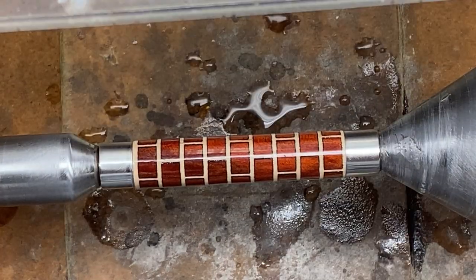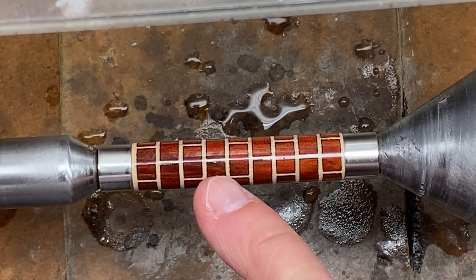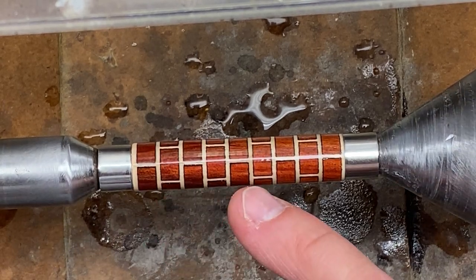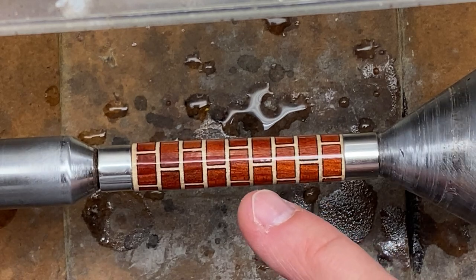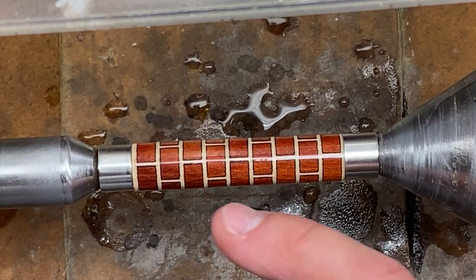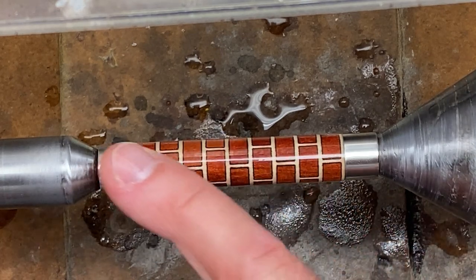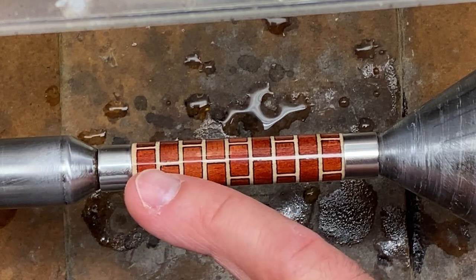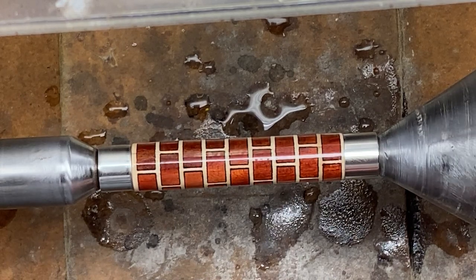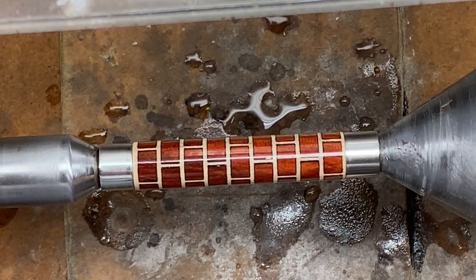I have finished my CA regimen and micro meshed the blank. There's just the slightest little indention there and there, and as you rotate, each time you get to one of the mortar areas, if you slow down and let the light above your lathe reflect, it should make a nice straight line — when it's crooked or lumpy, you can tell the blank needs a little more. These are really light, so I'm going to go with three more coats of medium, then come back and micro mesh the blank for the final time, and it's going to look absolutely amazing.